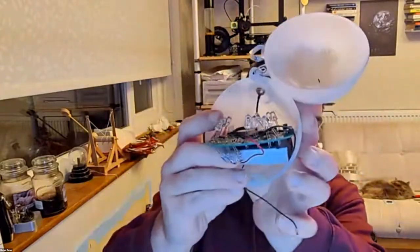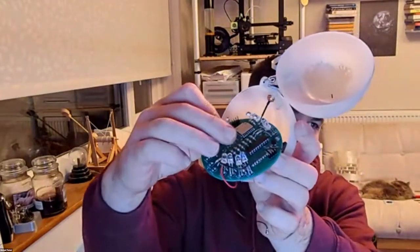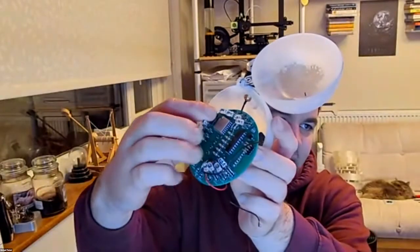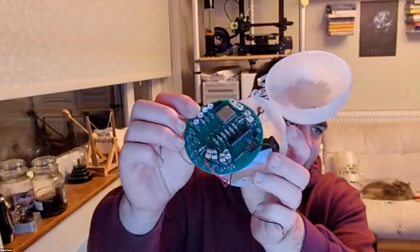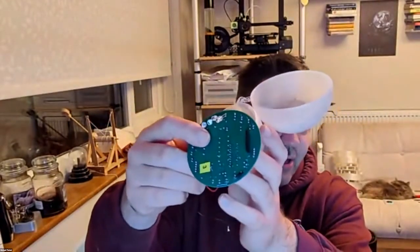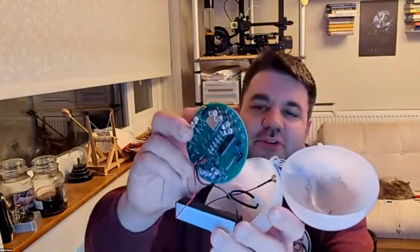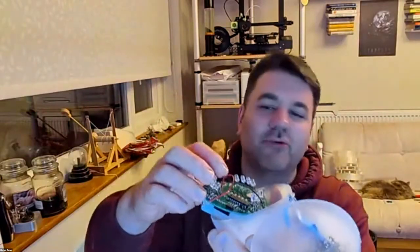And inside here you have a little PCB that I made, which is circular, has an ESP8266 module just there to do Wi-Fi comms, has a PIC chip microprocessor to do sort of very low powered stuff, some flashy LEDs, and underneath there's a connector. It's missing at the moment because I'm using it elsewhere, but an RFID reader, an MFRC522. It's a very common one you can get very cheaply from China these days, knockoff processors in it. You can get the whole reader for under £1.